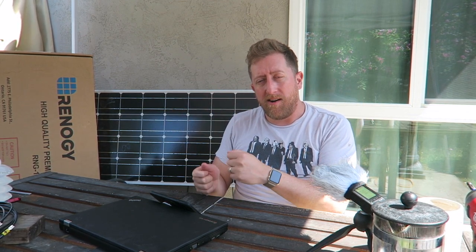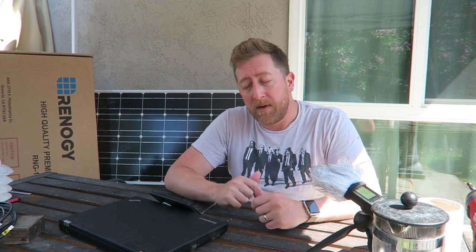The nice thing about the Xiegu X5105 is that it has a kind of built-in antenna tuner with a nice sweeping upside-down parabola view for the antenna, so you can fine-tune it visually. I'll use MFJ's instructions to get the aerials to the right length or in the ballpark. Once they're in range, I'll check the SWR on the tuner, and if it's not where I want it I'll try moving one or two positions on the trap, then adjust the vertical aerial legs until I find the match I'm looking for.